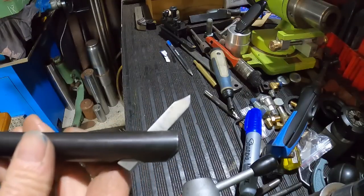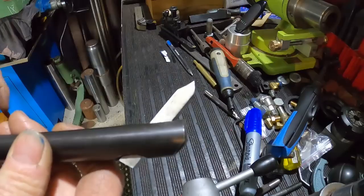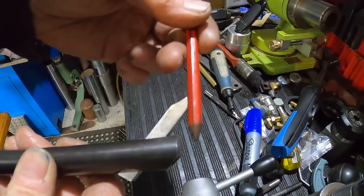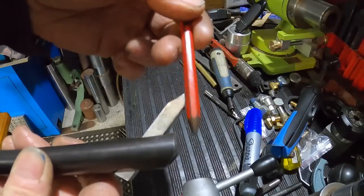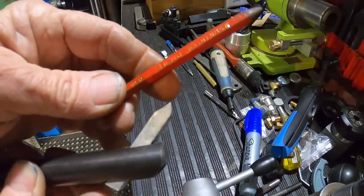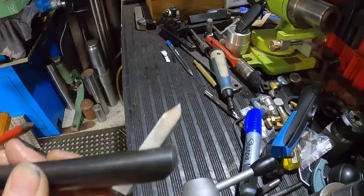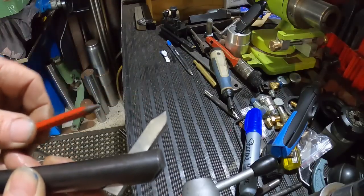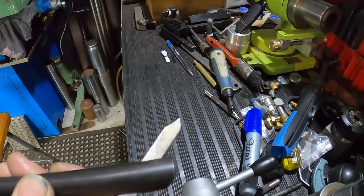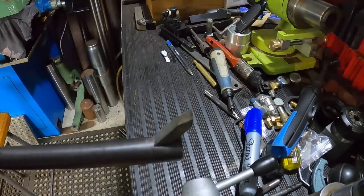So the tool that we were using, I've had to use the 45-degree hole in this bar to get the reach. So pretty well a 90-degree face where it was cutting, as we're cutting cast iron. Now there's a lot of back rake and a very sharp keen edge on the tool. The reason why we had a lot of back rake is because we're actually plunging in to take our cuts. So if we had the back rake to a minimum, it would be very difficult to start the cut. And as we're only taking light cuts, it worked well.